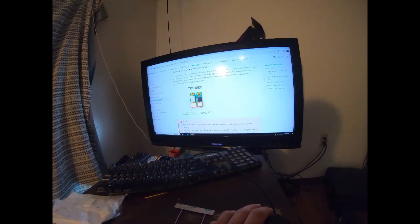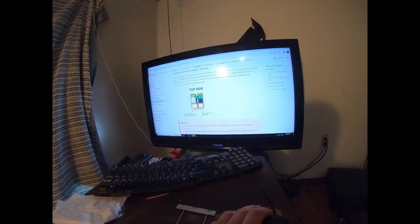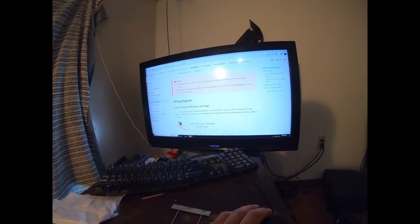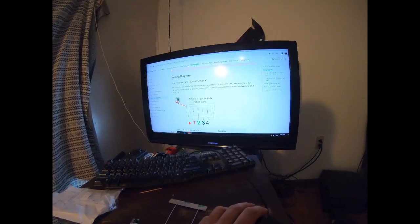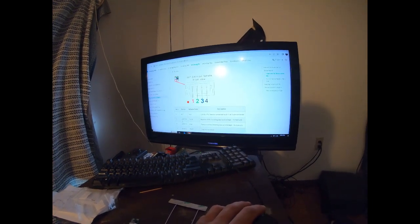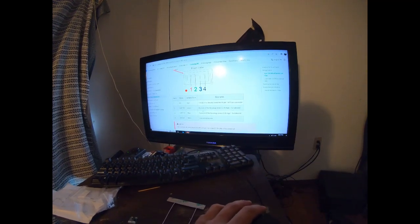So to be more specific, this is a plug, this is a plug. This is your UART plug that has power supply, and this is just strictly a power supply. Right here it says do not use, blah blah blah. Make sure your power doesn't drop below that or over that. For your UART side, it tells you the pinout. 1 is your power, 2 is your RX, 3 is TX, and 4 is ground.